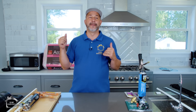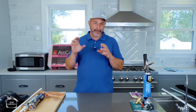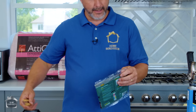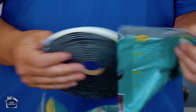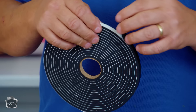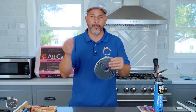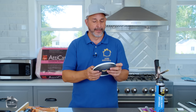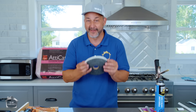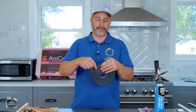If you've got good seals and good gaskets and your lock hardware works right, make sure everything's closing snug so there isn't any air coming through. You can adjust your latch plate to close the door a little bit tighter if you need to. There's also foam sponge with two-sided tape that works for both windows and doors. For old wooden windows or doors with unique jamb framing systems from the 1930s, this is really handy — just take off the extra tape backing and apply it to your window or door edge.